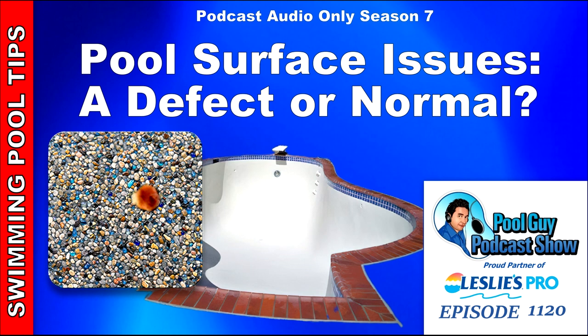There's also crazing and cracking, which is a natural part of cement. You'll see a lot of this in a pool that has just been plastered, especially on step areas. If you have a raised step in the deep end, you're going to see a lot of this because crazing and cracking are caused by excessive drying of the plaster before the pool is filled. The step in the deep end is probably the last part to get filled, so it gets hit by the sun and may dry out.